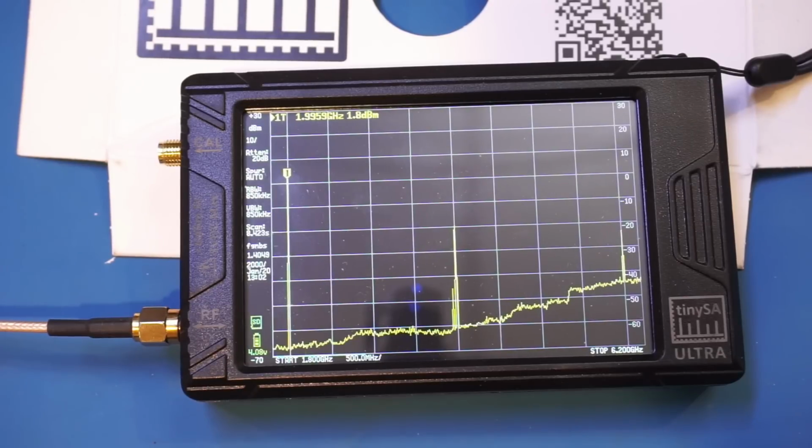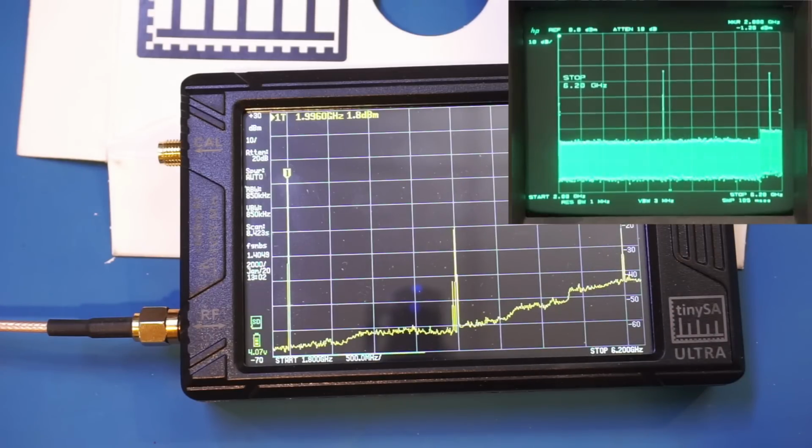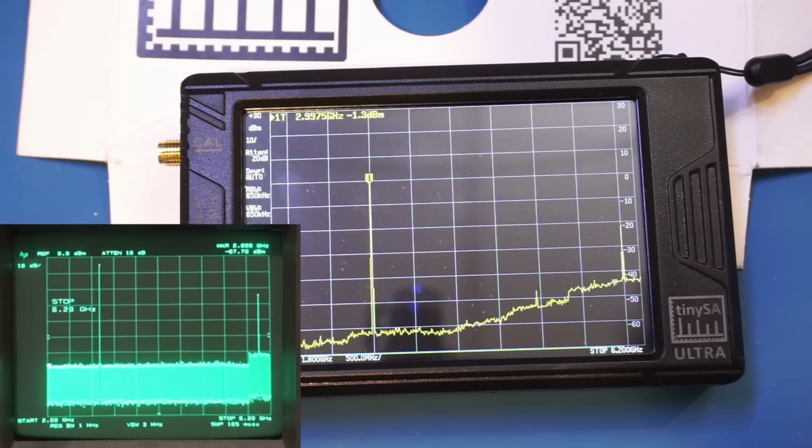Anyway, let me increase the frequency and see what we get on the spectrum analyzer. And don't pay too much attention to the amplitude, as the output from the 8671A is not level. But let's increase it to 3 GHz here. Of course, we have to wait till the scan completes. No problem. And let me increase the output to 4 GHz.